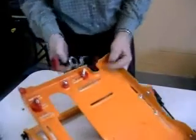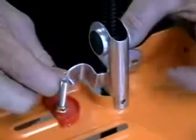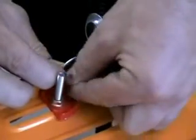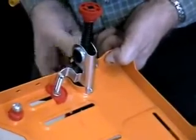Attach the galvanized bracket on the winder assembly on the inside of the U-shaped cutout at the rear of the chassis using the little M4 set screws and the matching flange nuts. Trial fit this to get the orientation right.